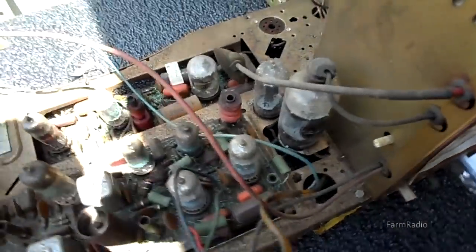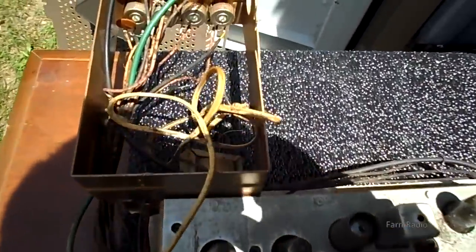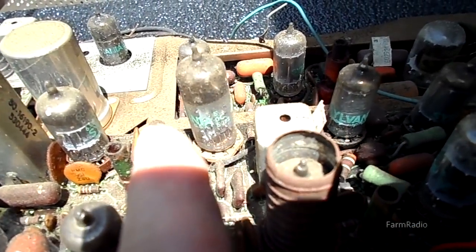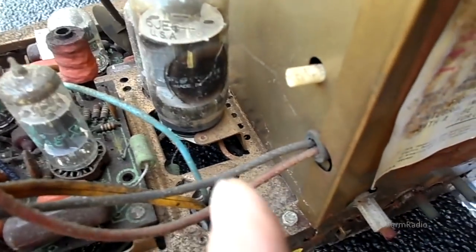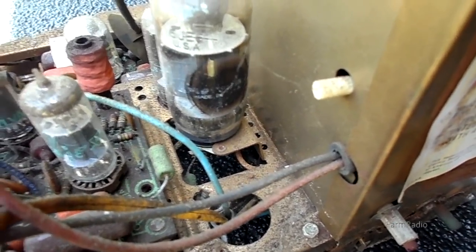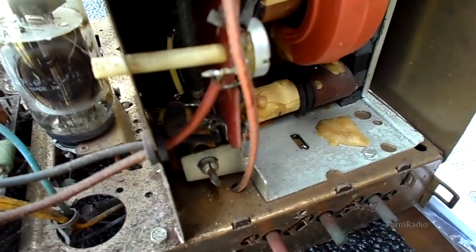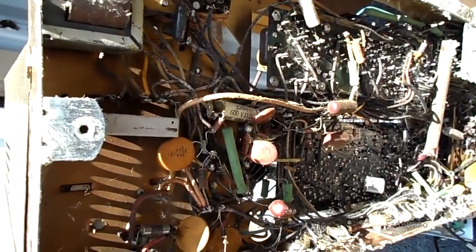Just a quick pan again of the chassis. We have mostly Sylvania tubes — there's a Dumont, an RCA for the AGC sync separator, vertical oscillator and output, and a Raytheon. The output tube, the 6JE6, is an Emerson. A quick peek at the flyback — just a little rusty, not bad looking at all. The focus rectifier stick — someone had been in here before because the tab on this side is broken off. Quick pan of the underside.